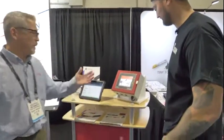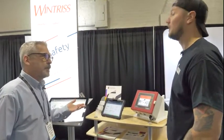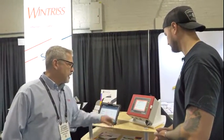So what we do is monitor the machine in real time. If the machine stops, we know it's stopped, and you decide what a significant stoppage is. On one of your machines you might say: if the machine stops for more than 10 minutes I want to know why. I don't need to know if it stops for a minute and a half for a quick tool change, but if it stops for a significant amount of time you're going to want to know why.